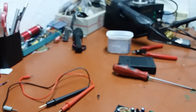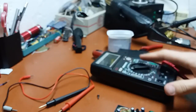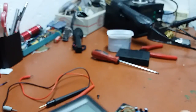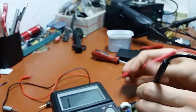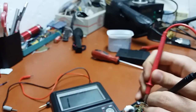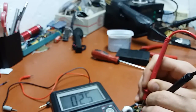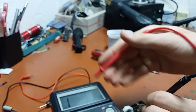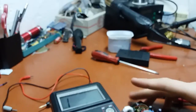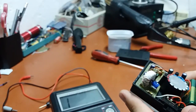So those two resistors I was talking about — you can see them. If I measure them with a multimeter, you will see that one of them is open. It's showing overload, meaning the resistance is much larger than it should be — that's the open one. The other one reads about two ohms, though that's in-circuit so don't rely on that reading entirely. I'm going to go and replace those two, and in the next part you'll see this thing operating like it should.